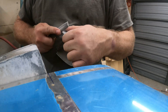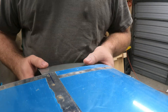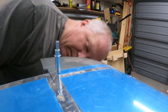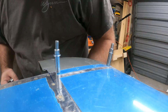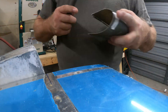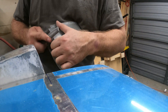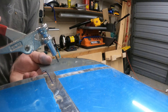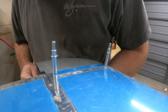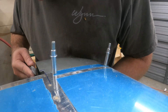Here I'm going to go with it — basically the tip flush with the elevator. I'm not at this point setting up for the 1/8 inch gap; I'll show you how I do that later in the video. So I put the fairing tip on, checking for interference and marking the tip again, then filing down to my new mark. I keep doing this until I just get the elevator to clear the fairing — continuing to move the elevator back and forth, seeing where it hits, and filing off the interference.